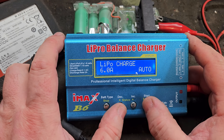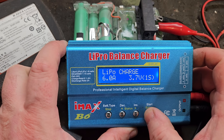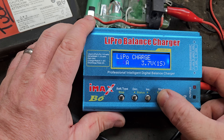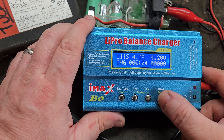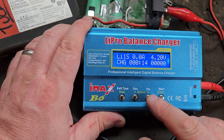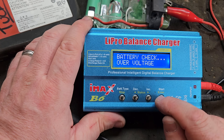What you do is go to 1S first. To be clear, 1S is one bank of cells, even though you're charging a 6-cell pack. Try her at 1S again to see what she does. If she's really low she might need to go to 1S. See if she starts putting any amperage on — yes she is, she's working. Make sure you have this on safety charge. When the amperage starts dropping, stop her and then go to 2S.